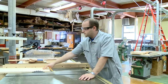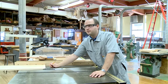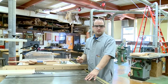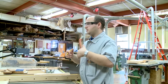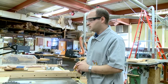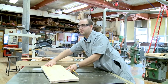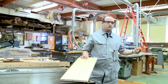So if you're at the back of the blade and you start to come off the fence like this, which way does the blade want to lift that piece? Up. Okay. So the reason the table saw is considered the most dangerous machine we'll work with is because of kickbacks. All right. Generally, all along, we've said as long as your hand is away from the blade, your hand doesn't go near the sandpaper on the sanding disc, whatever, you'll be fine. The difference here is when you have a kickback, it's going to lift that board up, pull the board back, and look where my hand is. Okay, it can actually pull your hand right across the top of that blade. All right, so that's where it becomes quite scary.